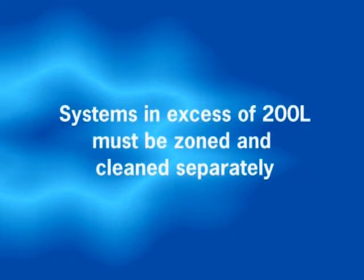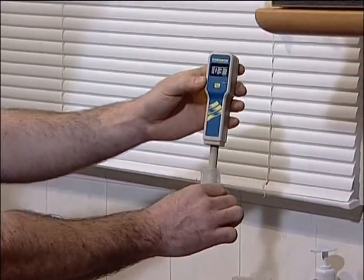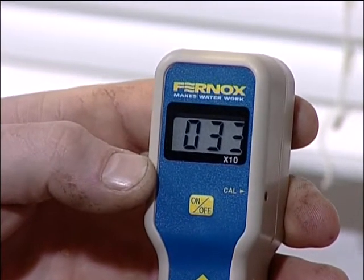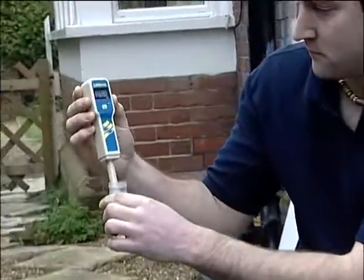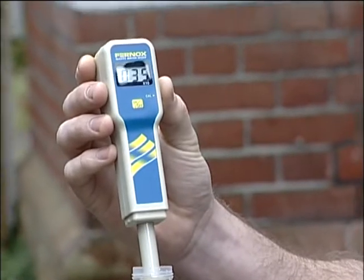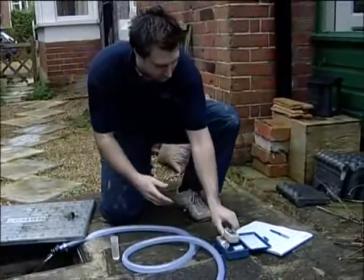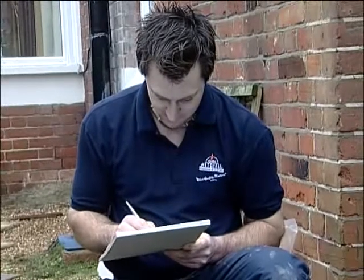Systems with a volume in excess of 200 litres, about 20 single panel radiators, will need to be divided into zones for cleaning — for example, clean the upstairs and downstairs sections separately. Monitor the discharge at the drain using the Fernox TDS meter and continue flushing until the water runs clean and the TDS meter reading is within plus or minus 10% of the mains water. Differences above 10% mean that significant dissolved solids have been left in the system. When the discharge is clean, turn off the radiator that has just been cleaned and open up one more. Repeat the dynamic flushing processes for all radiators, and at each stage check with the Fernox TDS meter that the water is completely clean, making a note on the Fernox power flushing monitoring pad.